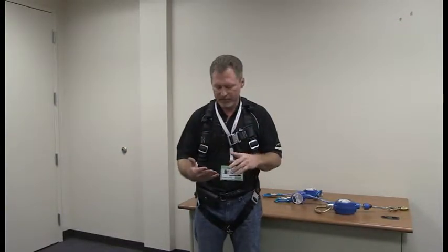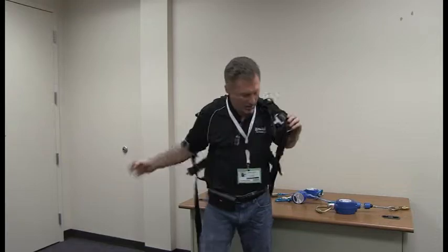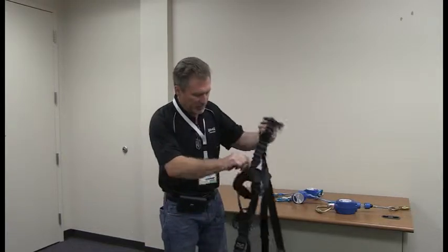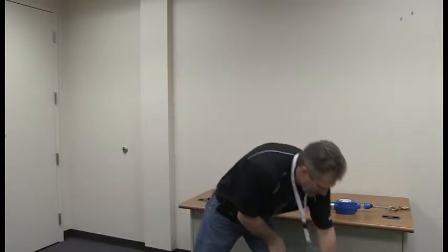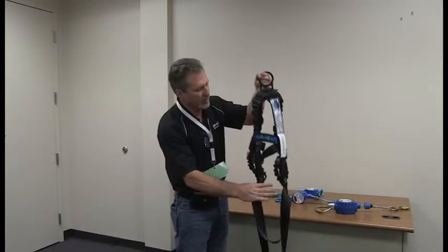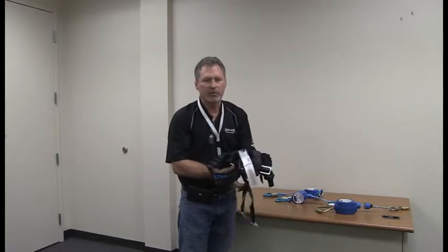Now that I've finished the job, I survived my suspension trauma death, what do we do with the product when we're done with it? Well, the way we put it on, we just reverse the process. I'm going to unhook my leg straps. I'm going to unhook my chest strap. And then when I'm done with it, am I just going to leave it on the floor? No, actually what we want to do with these is we want to store them in a cool, dark place, away from moisture, away from heat.